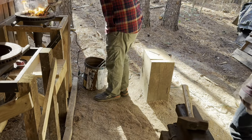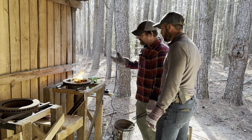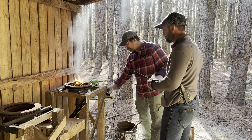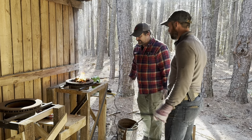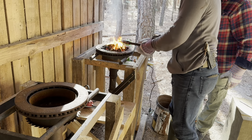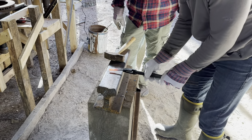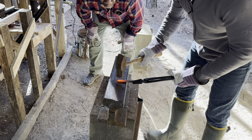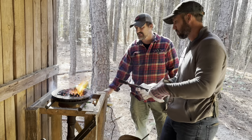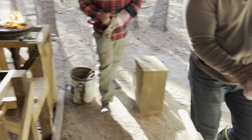Put that back in there - it's on you next. It's super hot in there; I can probably just leave it in for about 30 seconds to a minute to get that heat back. We're advancing the heat by applying the air. Go ahead and pull it out, check it - it's been in there maybe 15-20 seconds and we're already hot. Go ahead and hammer - try not to drop it in the dirt. That's about 10 seconds in the forge and we're back in business.